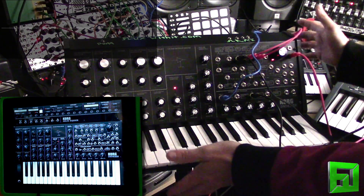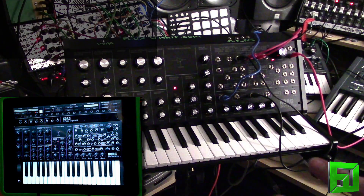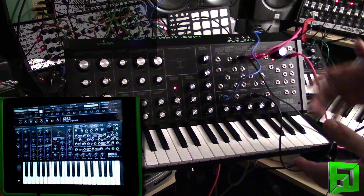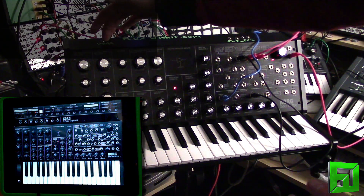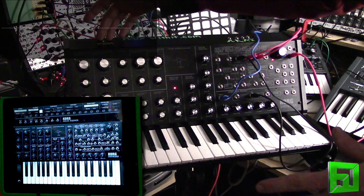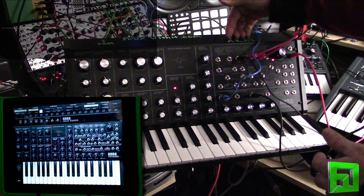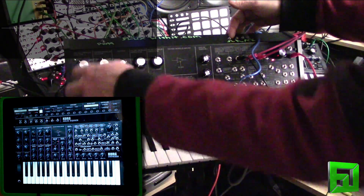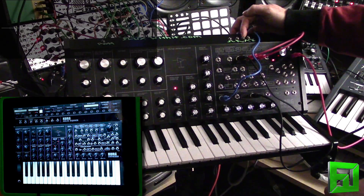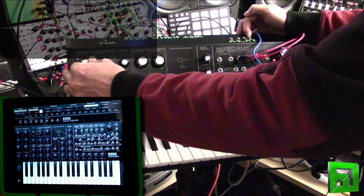When I got the MS-20 mini, a couple of things that I wanted to change about it: because I have a Eurorack behind the MS-20, I wanted to add some ports to it. So I added a pulse width modulation input for oscillator one, so that I can use an envelope or something to modulate the pulse width. I've also added from oscillator one: a square wave out, saw wave out, triangle wave out, and the VCO mix output — which is basically whichever waveform I've selected.